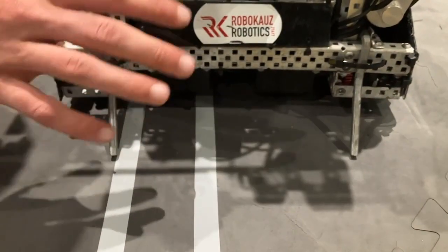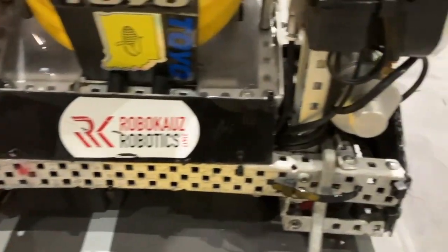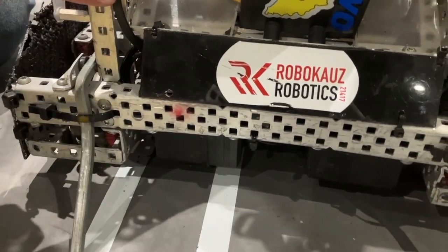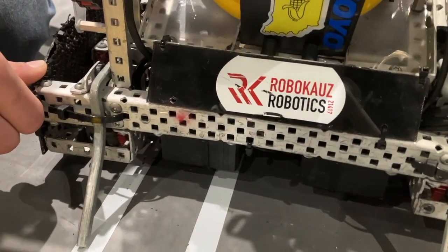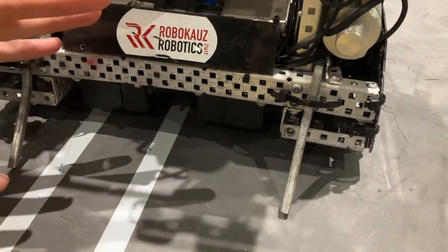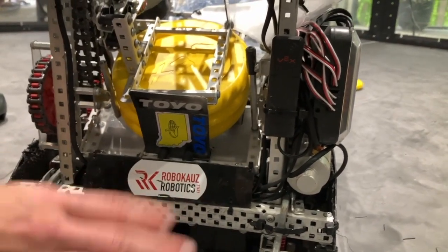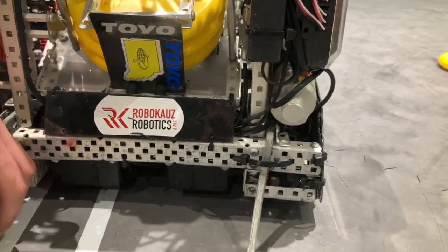We had these back wedges here made out of high-strength axles. We drilled a hole through them and bent them using a metal bender — we only broke one shaft doing that. These are probably stress-fractured, so we would not recommend bending them like this, but they did not break on us and worked for most of the year. We have zip ties to hold them down and keep them from flipping up. They also acted as an anti-tip for our robot, because running a 600 RPM drive in reverse can result in the robot flipping over. We only did that twice at practice, but this was a precaution. They're not tensioned down so disc can slide off, and they worked great for helping us push other robots given our low-torque drive ratio.